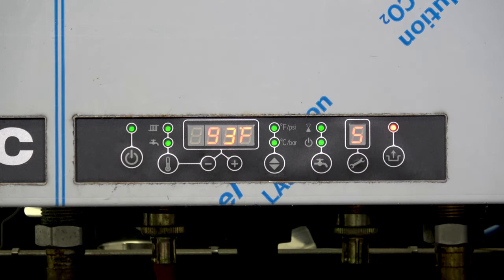The next option is lowercase n-dot. This is when we are trying to maintain a warm block for our on-demand hot water when using the DC combi boiler — what temperature are we maintaining that block at, whether in comfort mode (warm 24 hours a day) or eco mode (warm based on last three days of use). 110 degrees is a good starting point because the water in there will be at 110 degrees, and as soon as you start flowing water it'll be sending 110-degree water. Any higher and you could be sending scalding water, so we'll leave it at 110.